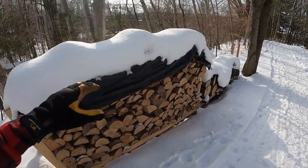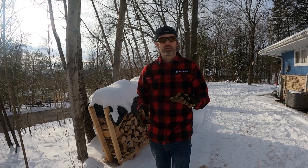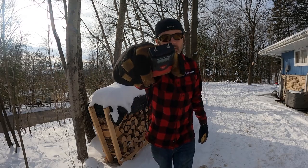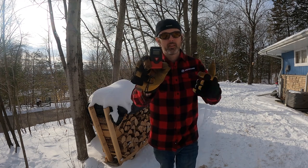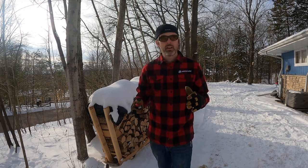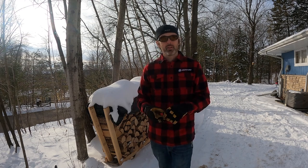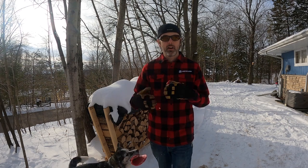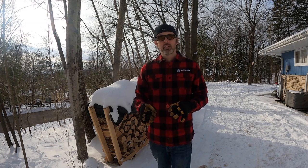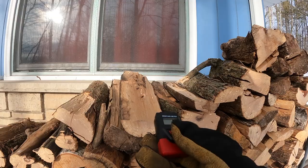In order to season wood properly and get it dry enough to burn it's really going to take almost a year, probably at least six months. One of the most important things is to make sure your wood is dry, and for that you need a moisture meter — these are about ten bucks. You jam the two metal prongs into the wood and it tells you how wet it is. If you burn wet wood you're going to create more creosote, that black tar-like substance that builds up inside your chimney liner. If you get enough of it, it can catch fire and cause a chimney fire and a house fire — it's bad news. The safest thing is to only burn dry wood; ideally without bark.